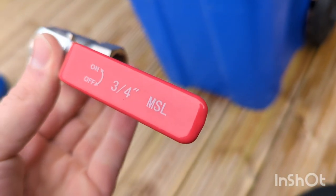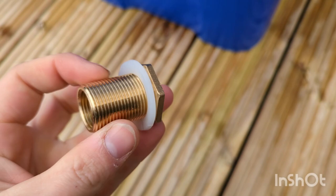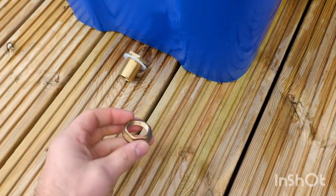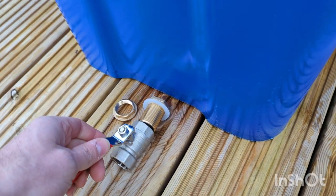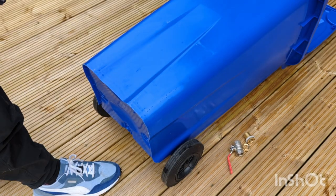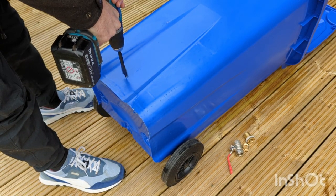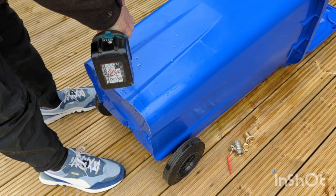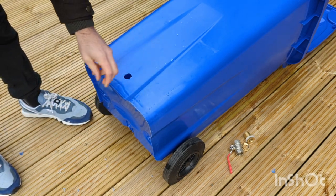This is a three-quarter inch ball valve and I'm going to attach that to a tank connector. These are quite hard to find from plumbers merchants, so I've found it best to order these off Amazon — I'll put the link in the description. I'm going to drill a 25mm hole; the one at the top was about 19mm and this one's 25mm. That will allow you to push the tank connector through the back, and it comes with a couple of little rubber washers to stop the water leaking.